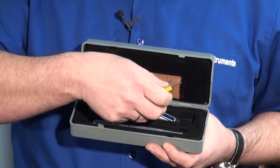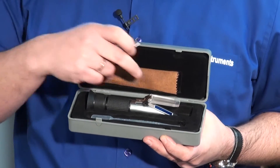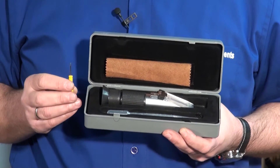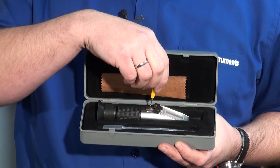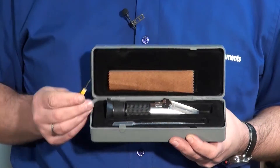To do the calibration, you have to put some distilled water on the front under the lid, look through in a natural light source, and turn the screw using the screwdriver to 0. Then the device is calibrated. As always, there is a multiple language user manual included.